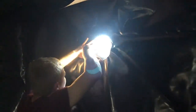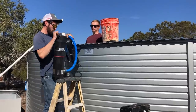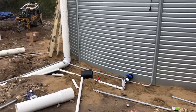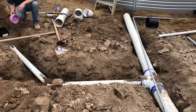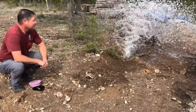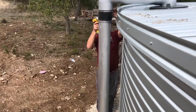Once it's full, the excess will go out through the overflow line, which is located on the back of my tank so that water will go out into the woods — the lower point of the area. To get the water out of the tank and back uphill, a small submersible pump is added to the inside and plumbed in. The six-inch line brings all of the water in; the conduit line powers the pump and gives me an outlet on the tank to utilize; and the return line is where the pump will push water back uphill to where I need it. There's also a shutoff valve, a hose bib, and a low-point drain valve that lets me flush the pipes out to remove sediment or prevent stagnant water from entering the tank.